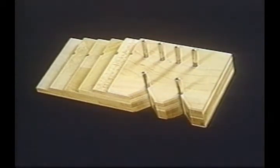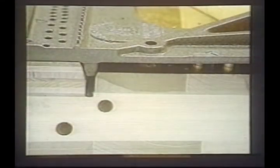The pin is in place to show how it is grabbed down its entire length by the end grains of its maple laminates. This is our patented hexagrip construction. It is still ours alone, and the gripping power that this hexagrip construction provides gives every Steinway piano a tuning stability that is by far the strongest in the industry. The vertical uses the same hexagrip pin block, carefully fitted to the plate, as in the grand.